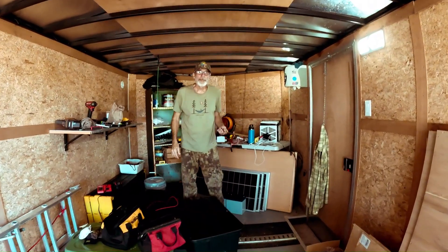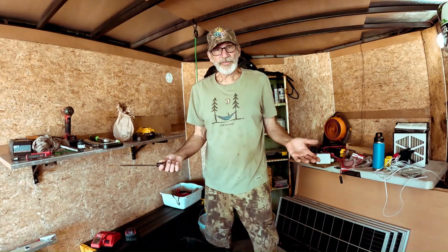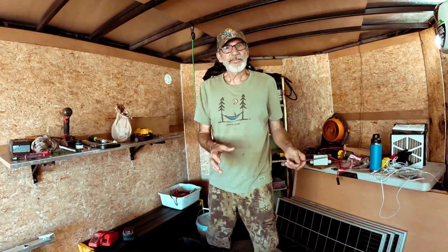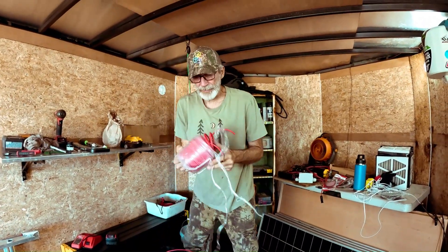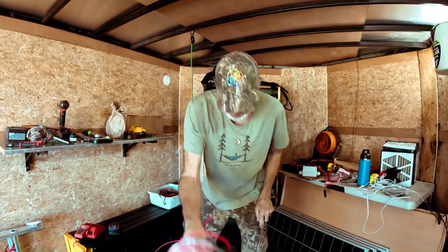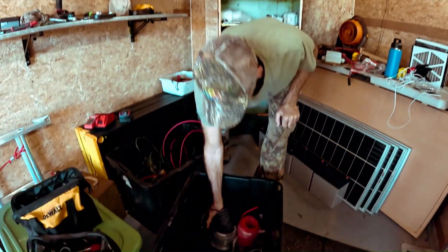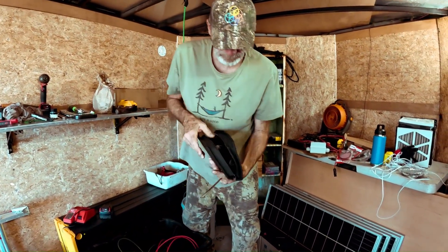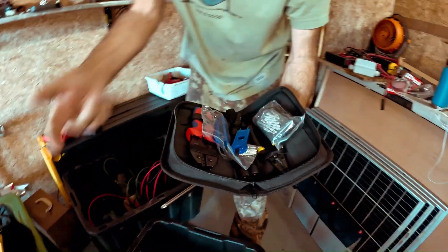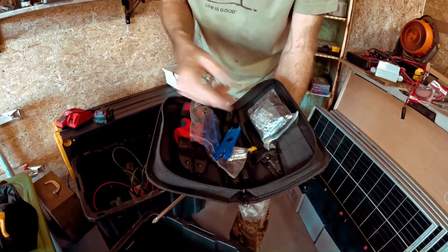While Trent's hooking up the battery cables, I'm going to get ready to build the solar panel wires to connect our solar panels. We're going to have six solar panels — three sets in series, all then connected in parallel. I'd buy the solar panel wires in bulk: red coil for the positives and black for the negatives, keeps everything separate. This nice kit, which we have links for, gives you everything you need to put the terminals on the ends. It's really simple and quick.